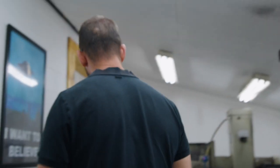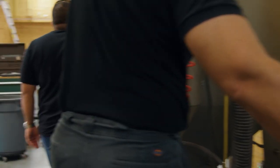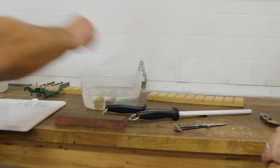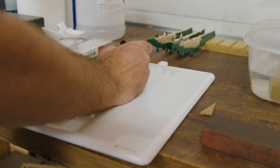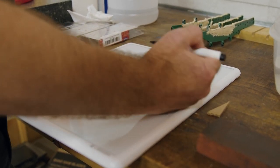You could use a piece of leather to drag it down, or a super high-grit stone — a couple of fine passes to remove the burr. A 'super high-grit stone' for me would be 1000 to 2000 grit. These honing stones aren't really for sharpening — they're for honing. The edge is already created and this just helps reform it. You should only do it once or twice — just a couple of passes until you feel your edge coming. Don't overwork it.